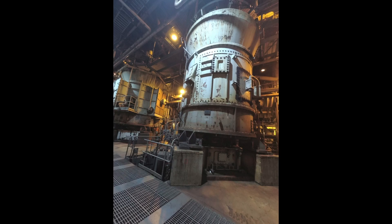This is an older style Foster Wheeler MB pulverizer. The actual rollers sit in here. Down here is the gearbox and the turntable. This part is where the air comes in. There are scraper bars inside that carry any debris that doesn't get pulverized down to the pyrite hopper — that would be rock, tramp iron, hard pieces of coal, stuff that gets kicked out the side of the roller mills and drops down the air ducts.